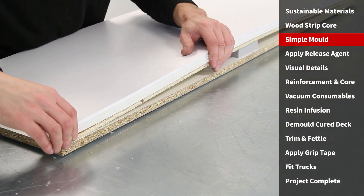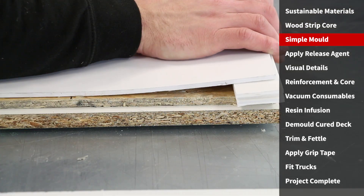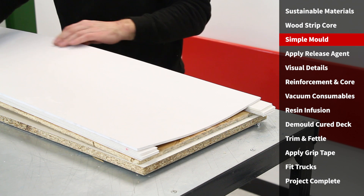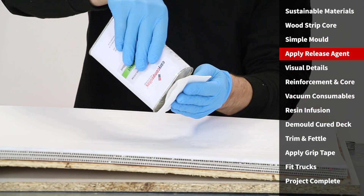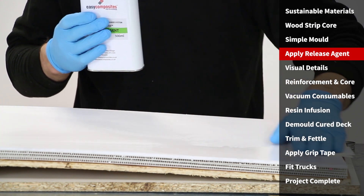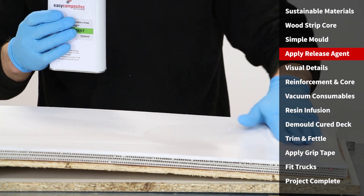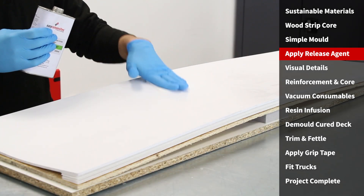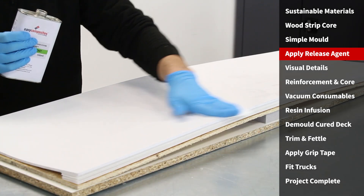As the center of the PVC sheet is firmly glued down, it is forced into a double curvature. As with all new molds, we will need to apply six coats of Easy-Lease to ensure that we get an easy separation of the part from the mold. This is done in the normal way of applying a thin film and waiting 15 minutes between coats, and then finally an hour before use.